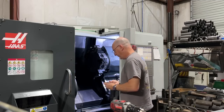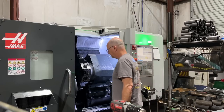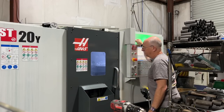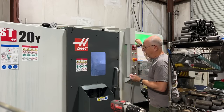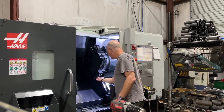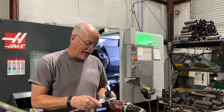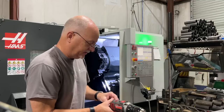Just got a couple more of these to go — very fast process. Now, we found that before doing this heat treat tempering process, the inserts on the tools were lasting like maybe between 5 and 13 parts. Really terrible. It's a very tough process — tungsten carbide insert, coated, but it just gets abused. Tungsten inserts don't like interrupted cuts, and having something that's super hard and then not hard — going from different hardnesses is kind of the same as interrupted cuts as far as the inserts are concerned.